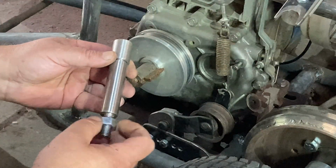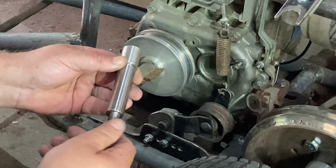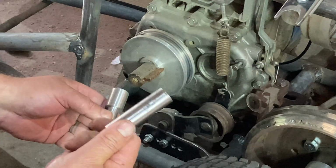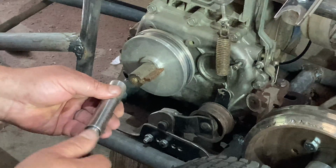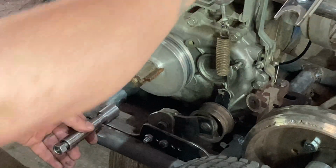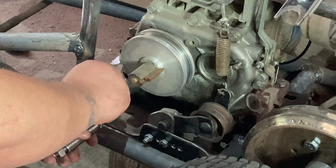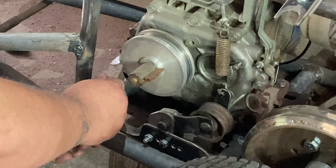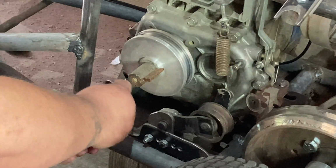Piece is built here now. This is the pivot that we built out of the rebar. So that was the piece of rebar. This is the piece of jack handle, goes over like that. Threaded it, so that we weld right there. Now this piece here was out of that square chunk, and we'll weld that there. This bar will have a linkage going back to our brake shoe. That will activate the brake shoe.